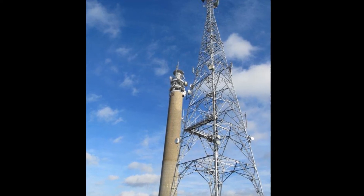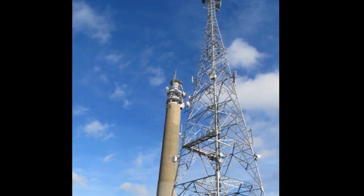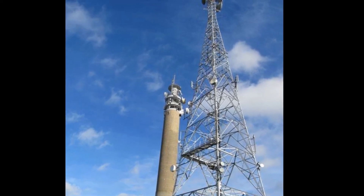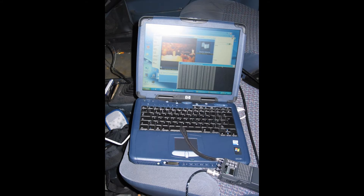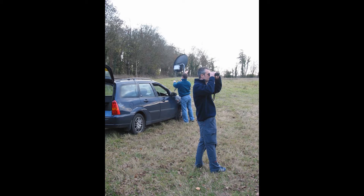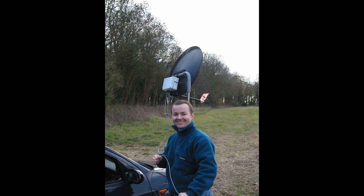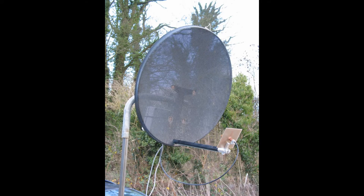This transmitter is a TV relay transmitter built in the 60s, used to relay television signals from London to Birmingham. It's very high — the actual ground is 732 feet above sea level, and the tower is another 387 feet tall. It's solid concrete, so it's quite a good location. We had pings going on the screen of the laptop, and we were using the Yaesu FT23R handheld — no Baofeng back in those days. Derek had a much bigger dish — the original Skydish — which he had up on a very tall pole on the side of his house, with his access point in a box fitted to the back to reduce losses, because at 2.4 GHz you want to keep the lead as short as possible. Then we just ran power and data from the access point back down to the laptop.